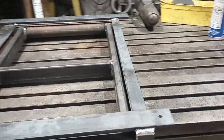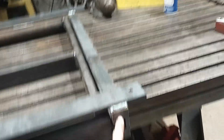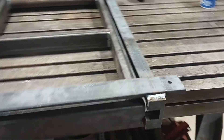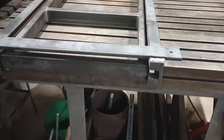The reason for that is because this tube is so close to the width of the channel, you don't have a lot of motion here. If I'd had narrower tube I could have had this notch higher up here and had more protection from it banging, rattling, and bouncing over the edge. I don't think it's going to, but that's just one of those things you don't realize until you're underway and building it.